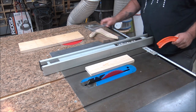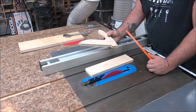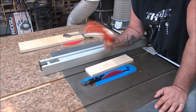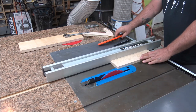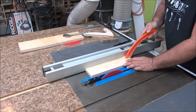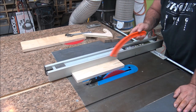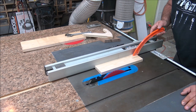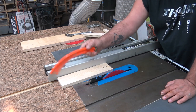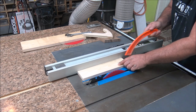Let's talk about push sticks and push shoes — the two things I keep right next to my table saw at all times. This is a push stick; this is what's commonly referred to as a shoe. One of the biggest mistakes I see all over the internet is how people use their push sticks. It's natural to want to get everything as far from the blade as possible, so people put their push stick on the far side. But watch what happens when your push stick is on that side of the center line — the wood separates and pulls away, naturally pushing the leading edge away from the fence. A better option is to keep your push stick away from the blade as much as you can, but stay on the near half.